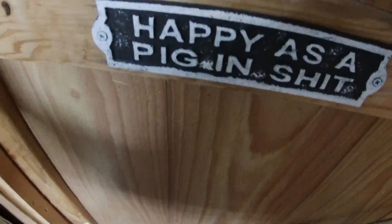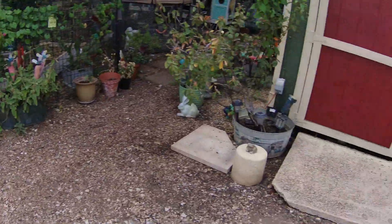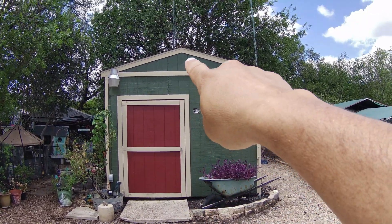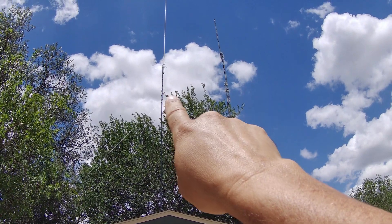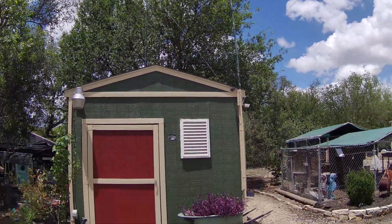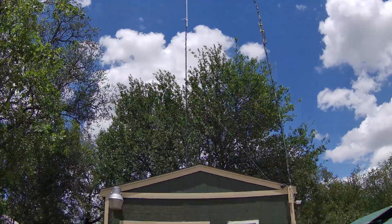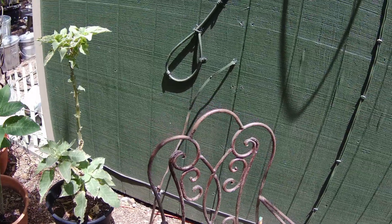Let's go outside and take a look at this antenna. What we're dealing with here: this is a 12-foot building, with about a 2-foot stand, a 20-foot pole, and then a 17-foot GMRS-tuned antenna. So the base of the antenna is probably just shy of 40 feet. When we were kicking almost 40 watts out on that, we had all that range. We've already ordered what I think is a 54 or 56-foot easy-up pole.